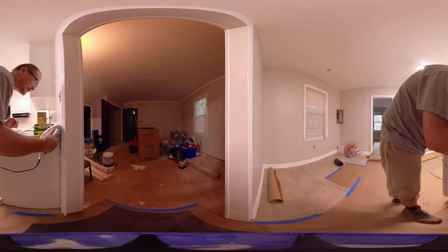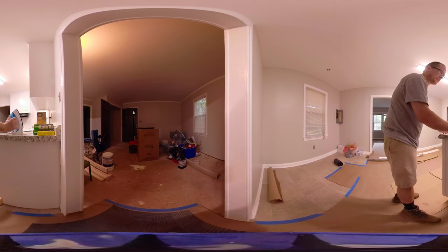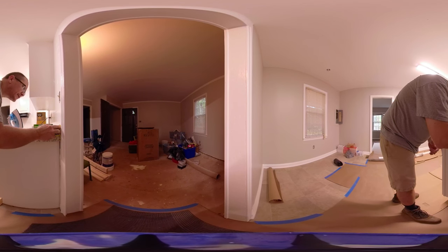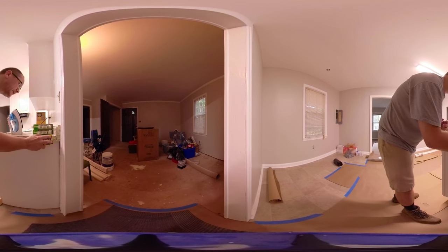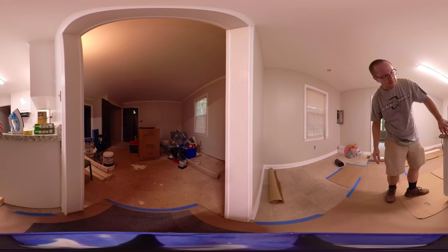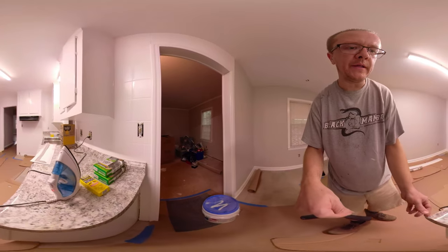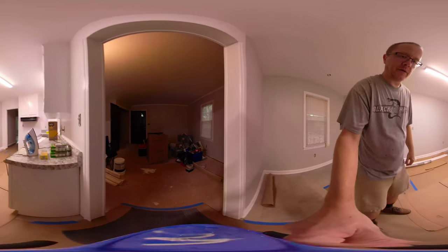If there's an area that doesn't look like it's sticking, just go back and hit it again — could be because it's too hot. Get something to press it on with other than your fingers, and once that glue is dry it'll be a good seal. Just make sure these edges are on good. Looks like it stuck pretty well, but this edge still sticks up a little bit, so I'll come back with sandpaper and knock that down smooth. I'm going to unplug this iron before I melt the countertop.